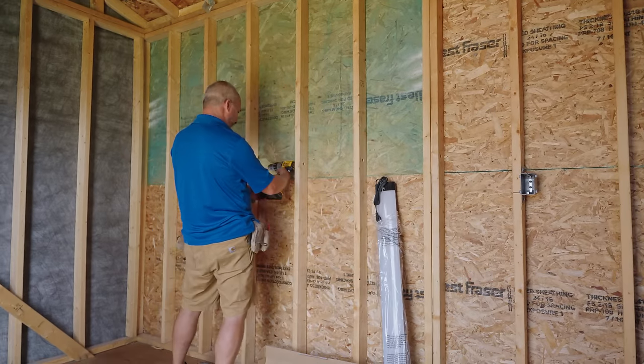Last little thing, details, so you don't drive your wives crazy or your neighbors. When you're putting these on, the screws go vertical. Not at 2 and 7 o'clock, not horizontal, they go vertical. Don't ask me why, but the consensus is in. Guys, if you're in the trades or you're running a handyman business, if you finish painting and you're putting all the cover plates back on, go by hand. Don't over-tighten, because that's tight now. Back it up until it's vertical. These things are plastic, unless they paid good money, $2 a plate for the nylon ones. That's how you finish it.